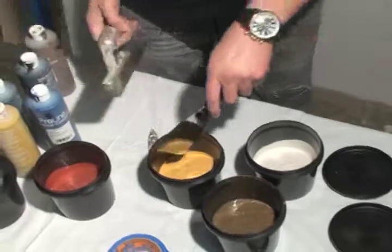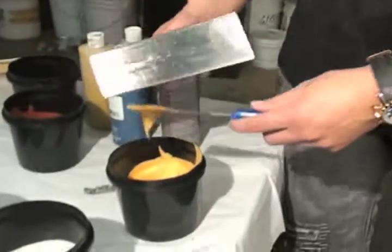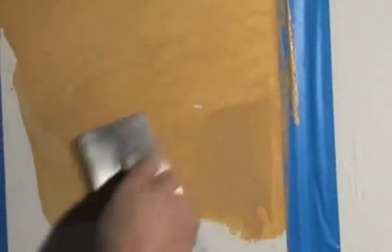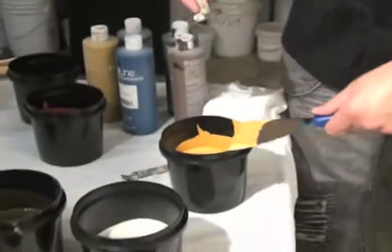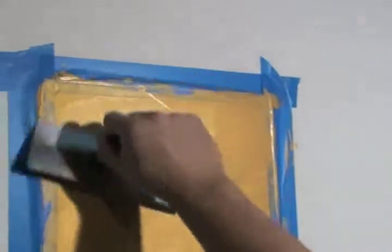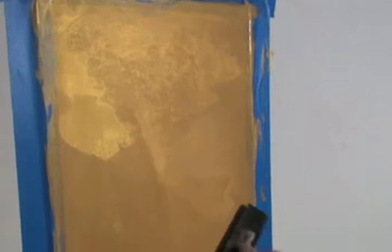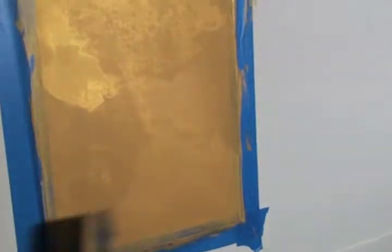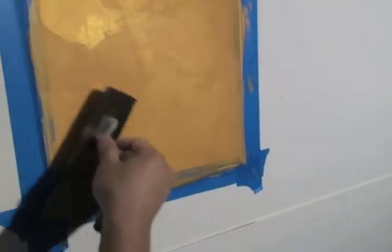To apply Pearlas Velvet, use a spatula to place the material on the trowel. Much like Venetian plaster, apply the first coat of Pearlas Velvet in multi-directional strokes to create movement. The first coat is simply a base for the finish, so ensure consistent coverage for the final coat. Let the first coat dry at least 1 hour. For the second coat, use less material as the surface will not be as absorbent. You have plenty of open time to move the material on the surface, so you can keep reworking the product until you have achieved the desired finish and movement.